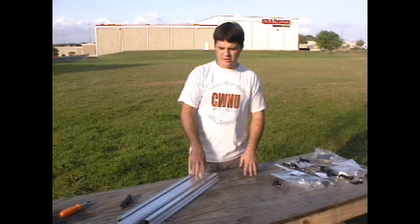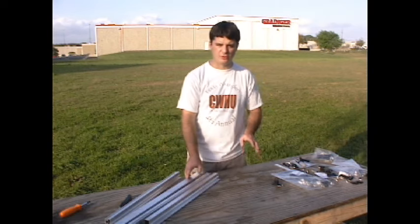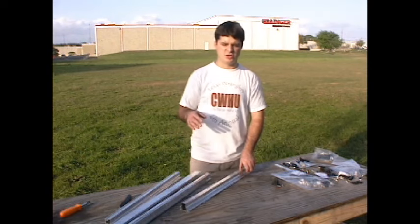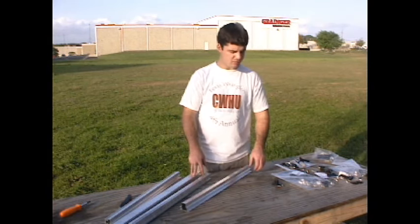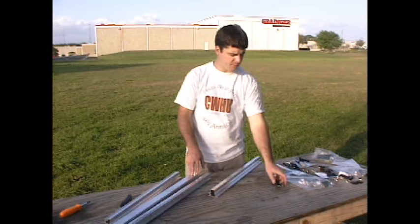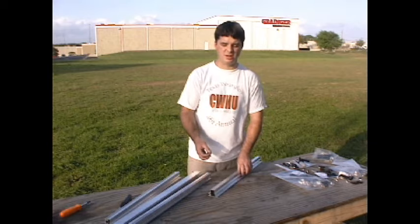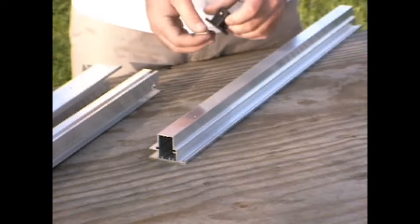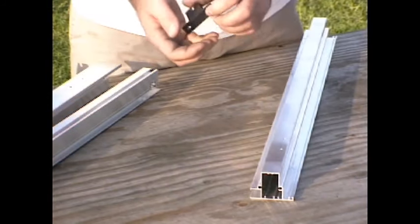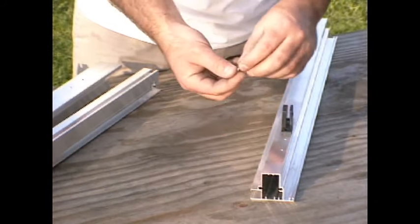The assembly of the rear wall window goes together the exact same way the upper front door portion does. So you could use the upper front door portion of the video to build the rear wall window. The one thing that differs from the old video is the part where your window bracket screws into the aluminum bar. If you look on the lower bar of the rear wall window, instead of having a bolt slot slid in to install the opener bracket, you have two pre-drilled holes, and screws supplied.